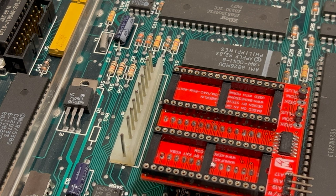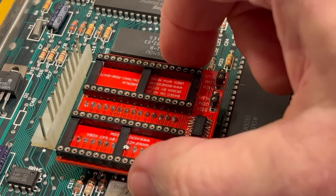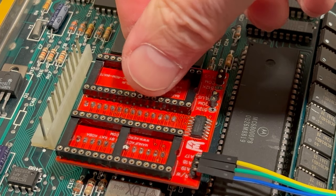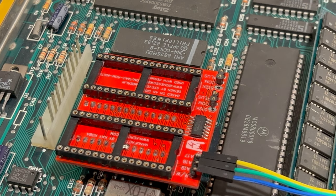So now this is where our header is. And so our wires are going to plug in like so. But we'll get rid of this one here because we only need three. All right. So I got to kind of see where we need these. You can kind of see that we got lots of extra wire here. And so we're going to trim them down. But what we'll do first is we will cut them and solder them up first, and then we'll actually attach them to the pins of the CPU there.